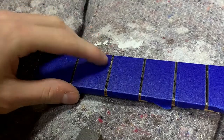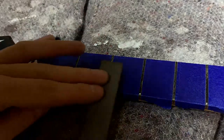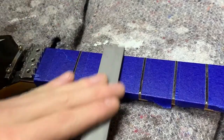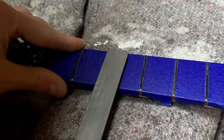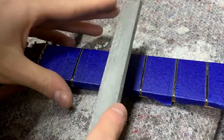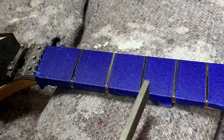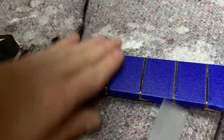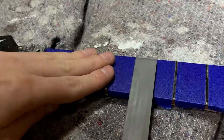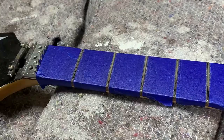This one here seems to be the worst — it's got a dent in it so I'm just going to start with a flat file and remove that and level it off. You can see the dent in the middle starting to go. I know it's going quite flat on top so what I'm doing is trying to work the file so we do keep a round edge to it. There are proper files for this but I just don't own any so we're kind of winging it here. Onto that next one — just a couple of little marks, let's get rid of those. You can see really evidently where those dints are as they leave the black.